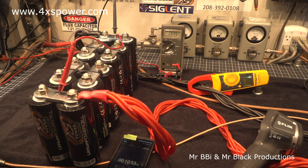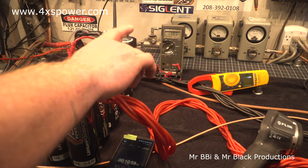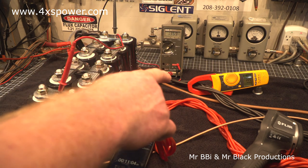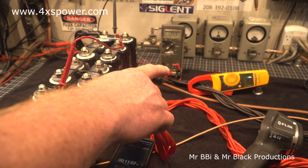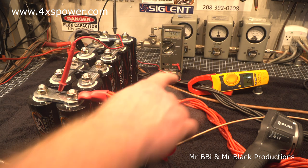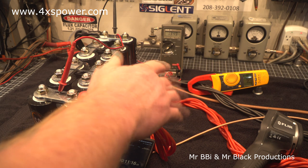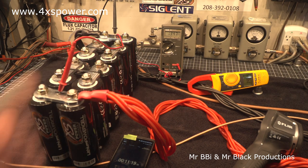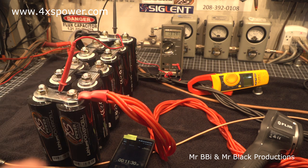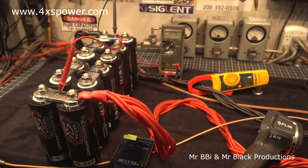Please note, we're keying the amplifier at a half a kilowatt dead key. So it's not like we're doing this all swing. We're putting a significant load of 130 to 140 amps on the battery when we key up. And we're swinging past that. We're up to about 340, almost 400 amps under modulated peaks. That is a 1,000 watt slug, reading like a 5,000 watt scale.